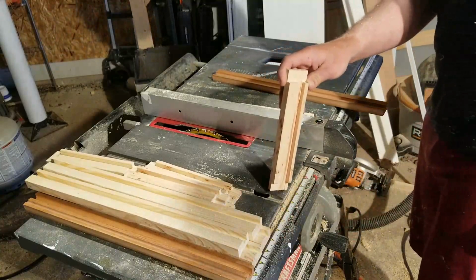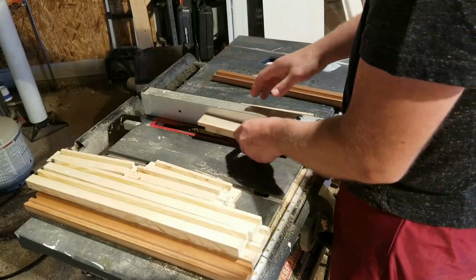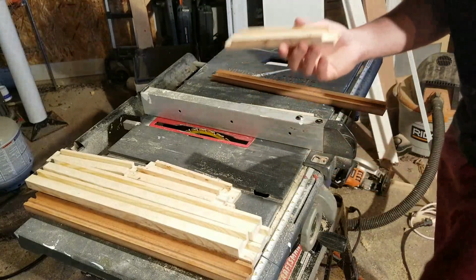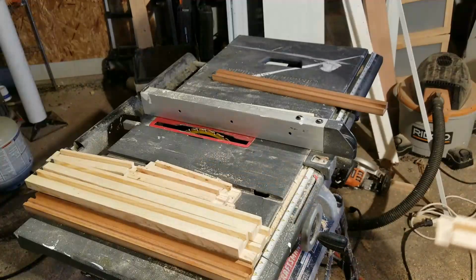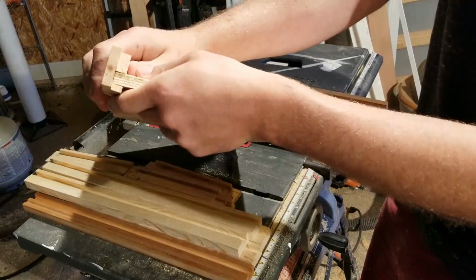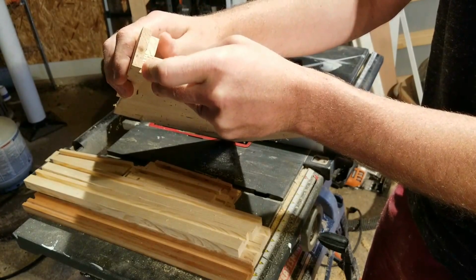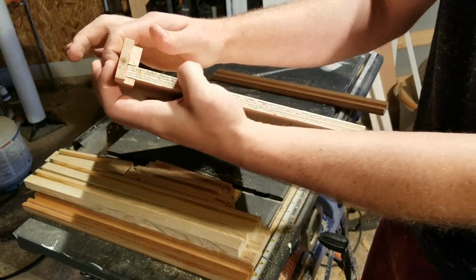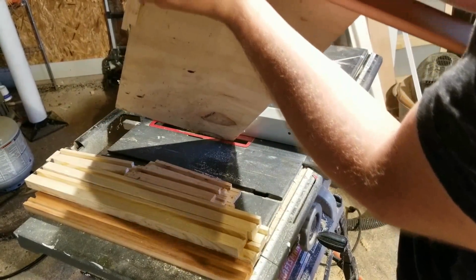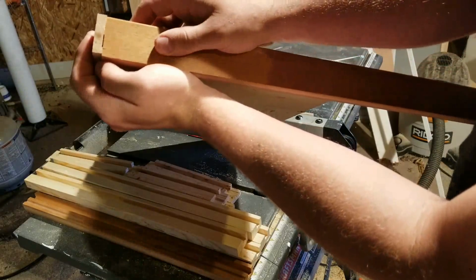So the easiest way that I check this, and again, I started with my 1/4 inch. I just wanted to leave a 1/4 inch on one side, and then I just kept backing it until I got to where I thought it was close. I did this one strip, and I'm just dry fitting it. So you can see there, it's a good fit. It's snug, but there's just a teeny bit of room. That's for the glue and the staples. So essentially, once we go to the next step, it'll look something like that when it's all buttoned up.